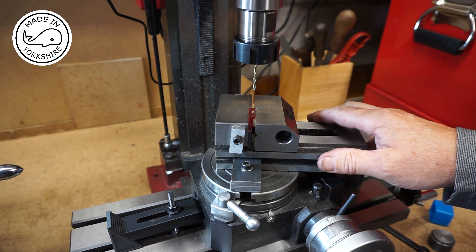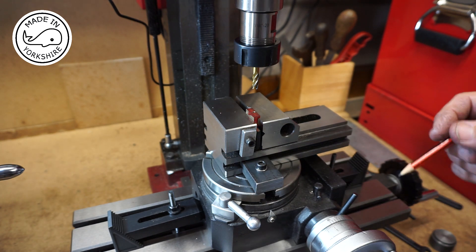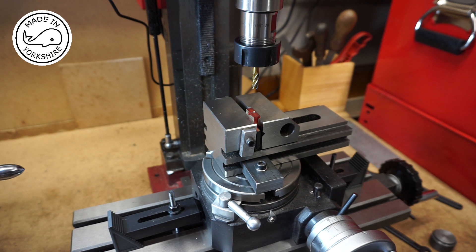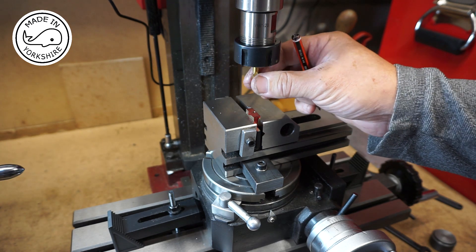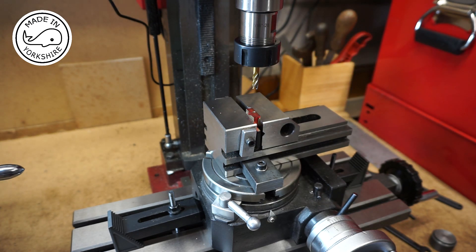So this is to create the boss, and here come the maths. The boss's diameter has got to be around 7/32 of an inch which I work out to be 0.219 of an inch. This is a 6mm end mill which equates to 0.236 of an inch. Those two dimensions added up comes to 0.455 and if you divide that by 2 you get 0.2275 of an inch. If I multiply that by 25.4 to get millimetres, I get 5.78 millimetres.